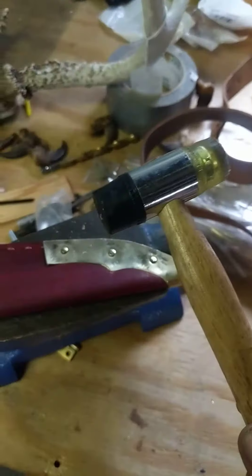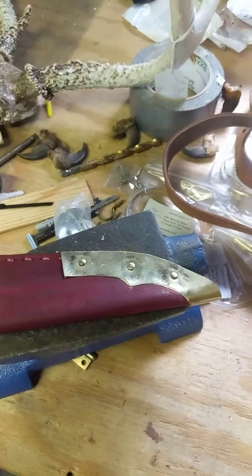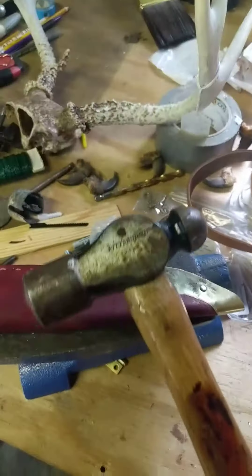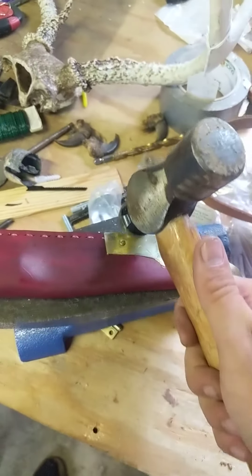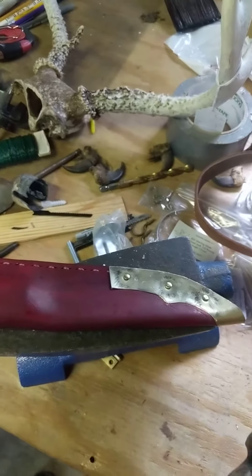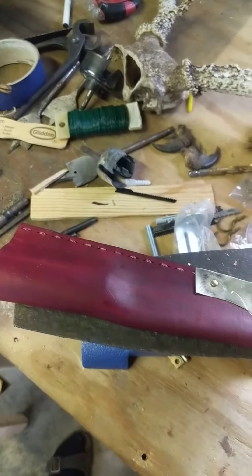Your best friend while doing these — I've got a rubber mallet. It's great for tapping any parts that aren't laying flat. I'm also using a big ball peen hammer, 24 ounce, so it's kind of a big boy. I hold it way up here as I'm tapping the end of the rivet to get it to lay down, and it's heavy enough that it does most of the work for you.